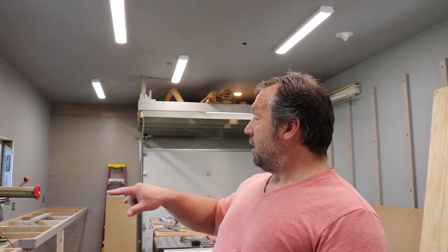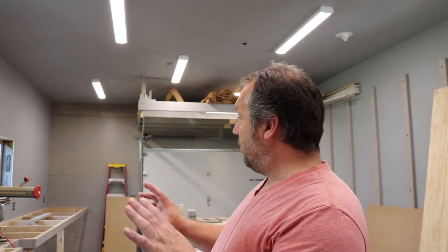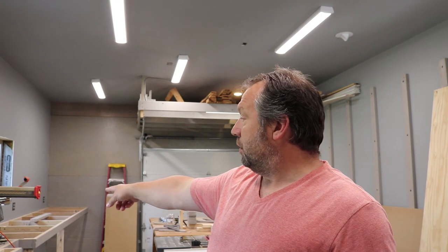Overall I'm really happy with the lighting levels - 33 to 50-something foot candles is pretty good. The only thing is I think along my workbench on this wall I may desire a little bit more lighting there, especially over my radial arm saw when I'm trying to cut real precise measurements. So I might add a fixture right up here above the bench - two more of these same type of fixtures would make it really bright. Either that or I could put under-cabinet lights there, but that doesn't really solve my problem of needing a little bit more light right above the bench.